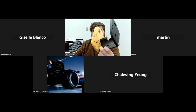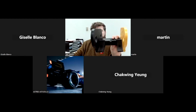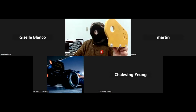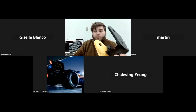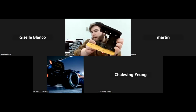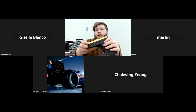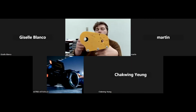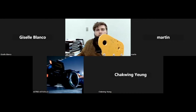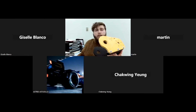enough at CAD. This is the head of a turret that was donated to my robotics team from Team 3161 Tronic Titans in Oakville, Ontario. This was created in 3 separate parts and bolted together using this sort of boltable design with hexagons embedded into it next to the holes, so you can just set a nut in and then screw it in. And this fits a Falcon motor or a Neo motor, as well as a turret wheel, usually a billet or flywheel. It's pretty cool. It ended up breaking a competition, but it's really interesting.